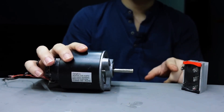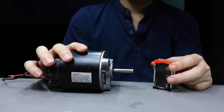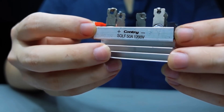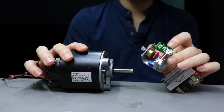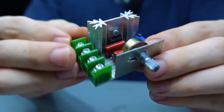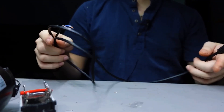But here's the catch: if we connect it directly to the power source, the motor won't work properly. It'll just spin half a turn, then reverse immediately. Why? Because AC — alternating current — isn't suitable for DC motors. To fix this, I've prepared a bridge rectifier circuit using diodes, which converts AC to stable DC power. On top of that, I've added a motor speed controller, allowing us to adjust the speed precisely to fit our needs.